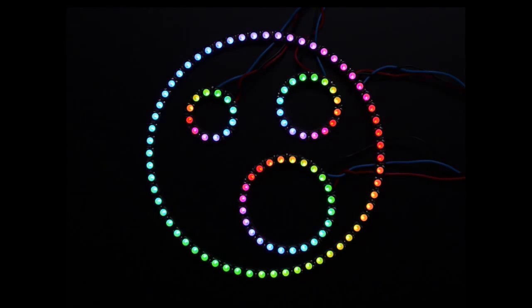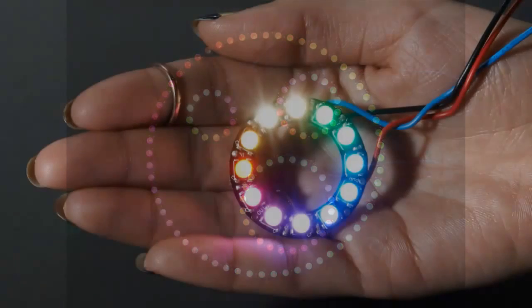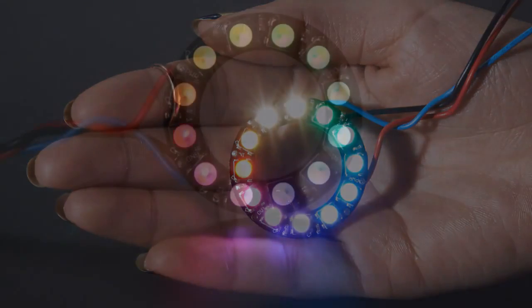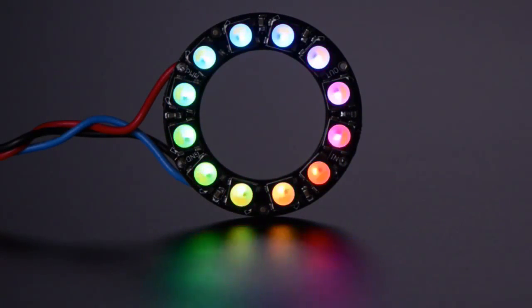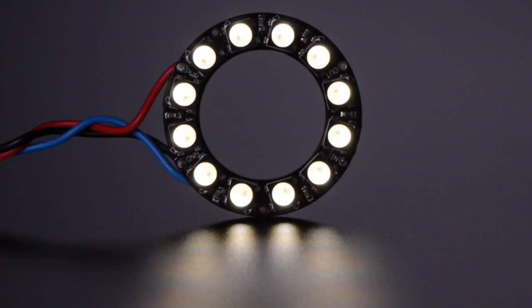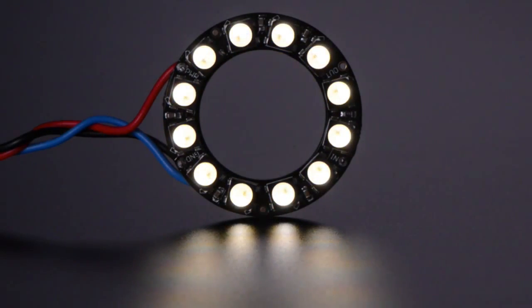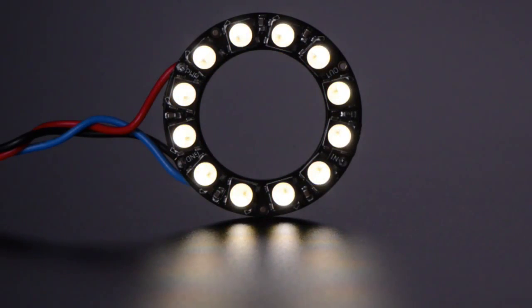So this is our NeoPixel ring section of the show tonight. We have like a face or something. We have rings and also jewels. This is the beginning of adding RGBW versions of all our NeoPixel rings. So you can tell this one has RGB — it can do a color swirl — but it also has white LED elements. You can mix and match them, you can have RGBW all at once, but it's easier to show with only the white LEDs on so you can see the color temperature. These are NeoPixel compatible, but they have four LED elements, so you just need to make sure that your library supports RGBW, which ours does. And we have these in all of the ring sizes.